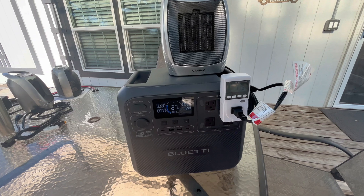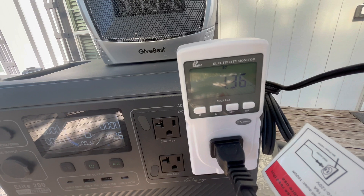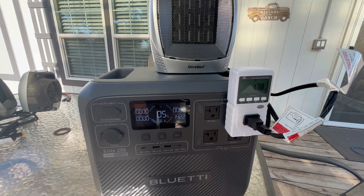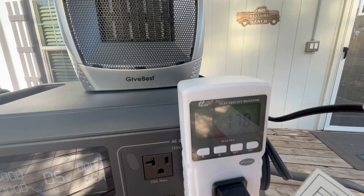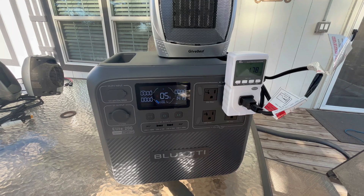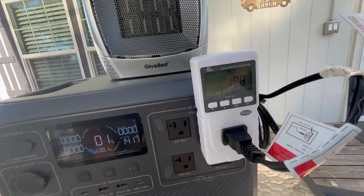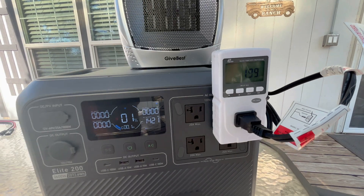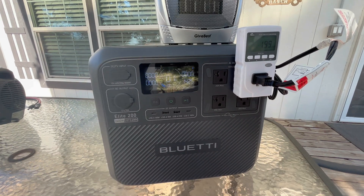It's been running for about an hour — still 27% left on the battery and we've used 1.36 kilowatt-hours. After about an hour and 25 minutes, there's 5% left and we've pushed 1.78 kilowatt-hours through it — looking really efficient, 85% plus. Down to 1% left, we've pulled 1.99 kilowatt-hours — right at 2 kilowatt-hours — which is about 97% efficiency out of this 2.073 kilowatt-hour battery.